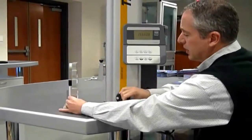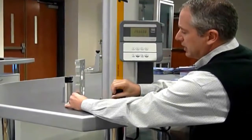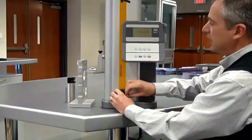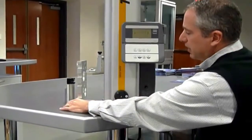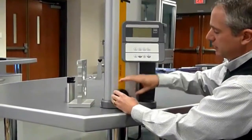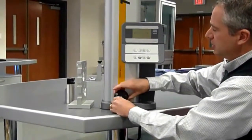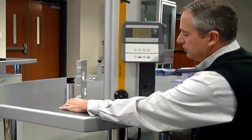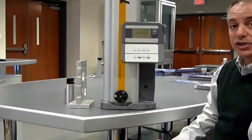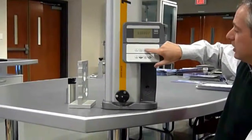You can measure a diameter with this gauge as well. Simply bring the contact up, apply some force, lock the contact in, and sweep to automatically find the high location. Bring the contact down, lock it in location, and sweep for the lower surface as well. That's the center line of that feature to the granite plate, and here's my diameter.